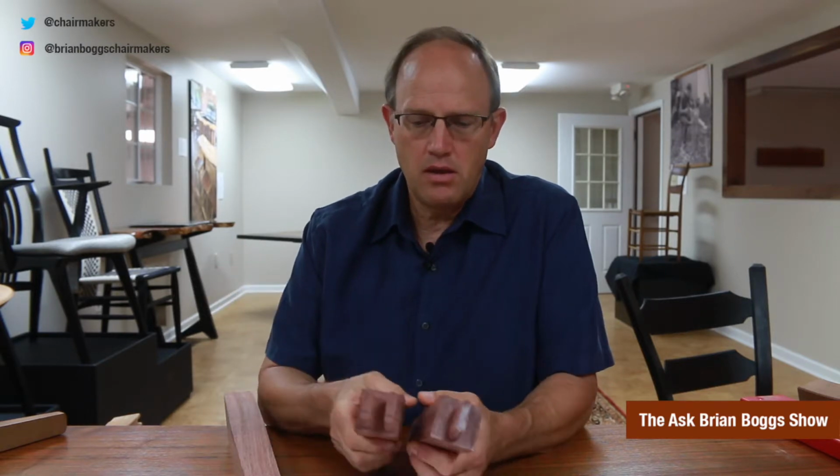So, practical in a shop, well, FMT jig and other multi-router systems are all capable of cutting an accurate tenon. Being able to cut an accurate tenon with a taper is just a matter of having a custom bit made. We can talk about that later. I'll make a commitment to post on chairmakers.com the source that we get these bits from. They are expensive. If you're going to buy one or two, I think there's something like $250 a piece.